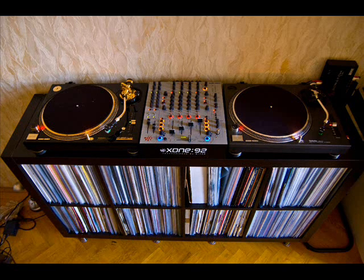So the records on the top shelf are actually pushing down on the pegs that are holding those short pieces up. Now on a small shelf like this, I don't think that's such a big deal. I would try to shore it up somehow, maybe put some L brackets underneath it where you can't see them, towards the back third of the shelf, so it's near the middle but not totally in the back, or put some backing on it. But some of these shelves just weren't meant to be in the position where you want them to be if you're going to load them down with records.